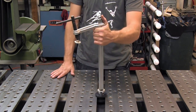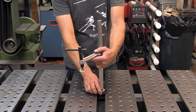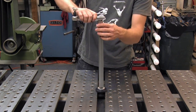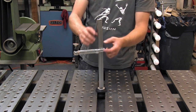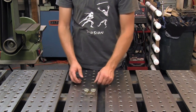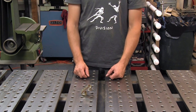These are the 360-degree clamps, and what I like about these is sometimes I need to clamp something that the other clamps don't quite hit perfectly because they're on a grid system. This one I can move outside of that grid system and get to the exact location I want. It also has a little key you can depress and flip the clamp over to push or lift upward. These little magnets I use quite a bit as well — they can hold two surfaces on the same plane, or hold a tab or bracket in a specific location while you tack it down.